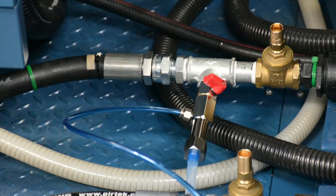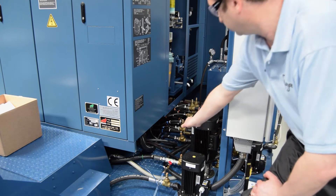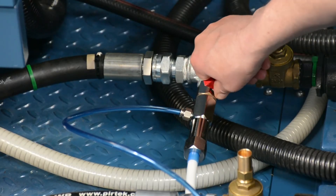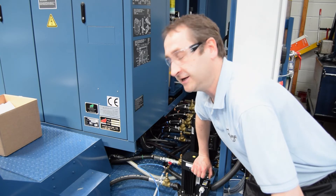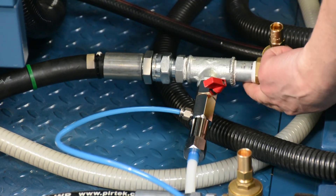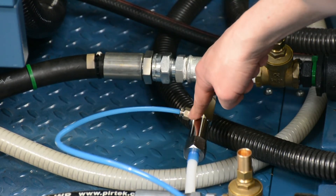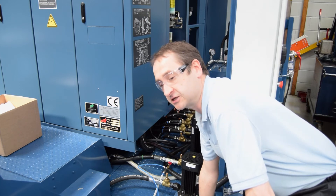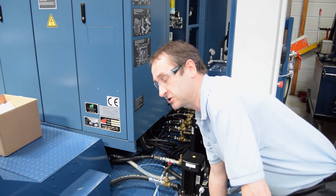We've teed off the system and we're ready to check for leaks. When the machine's put on we should start seeing the coolant — we're all sealed up and the machine is back on. We can feel the pump's back on. The valve is off at the moment so we're going to turn it on about halfway to start with. There we go — half way, and look at it going. That's all it needs to be — half way, doesn't need to be full on. There's the suction straight up. As soon as that's set there are no leaks. The coolant is going straight back out into the sump. This swarf bin had about 40-50 litres of coolant in it per shift before the coolant saver — now it'll go straight into the vacuum as soon as it comes into the bin.